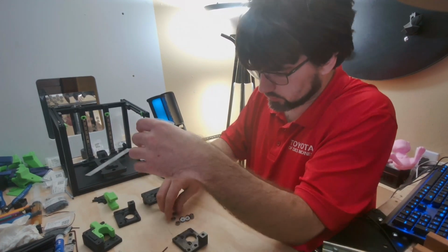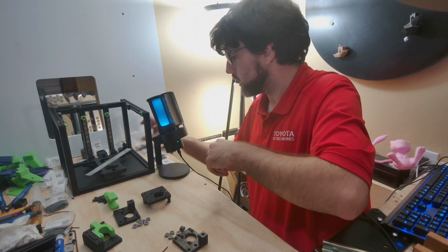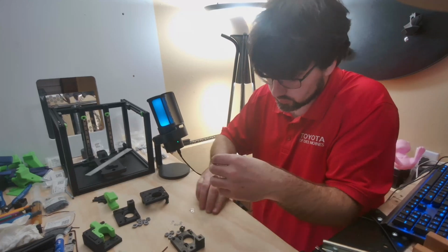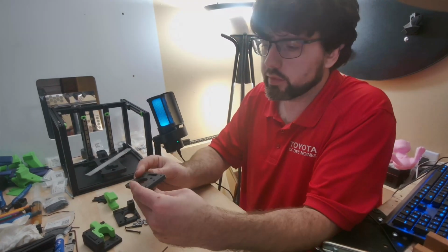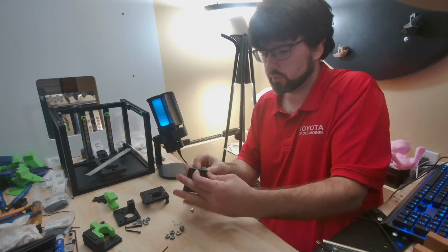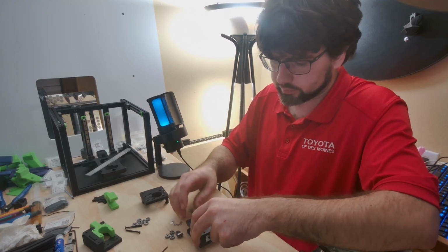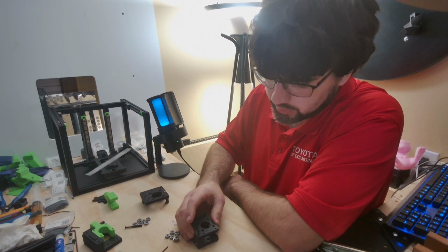You'll need 6 bearings per drive. And then for the shim rings, you will also need 6 shims per drive. Now you will be building this stack upside down. So what I'm going to do is use the other stack, at least on the first one here, to kind of keep it level. And this is just going to be a placeholder bolt to kind of keep that aligned there.